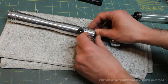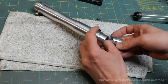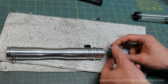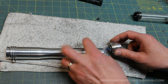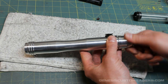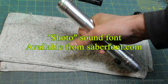I make sure the O-ring sits in the threaded section. Then I bunch my wires — here's a technique you'll need with threaded saber bodies. Before you thread a part on, because I'm going to twist it this way to thread it on, I first unthread it however many turns I think it will take and untwist my wires the wrong way, so that when I'm screwing it on I'm not bunching up the wires too much. I tuck my wires in, put the pommel in, and screw it on so the wires are untwisting — not catching or snagging. With the O-ring it holds the speaker really securely. Quite a nice seal. It's a nice loud saber because it's got the 1.5-watt premium speaker.